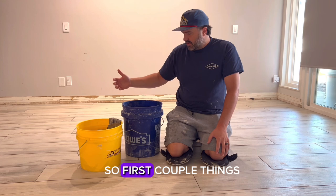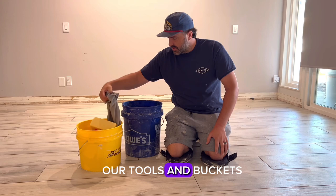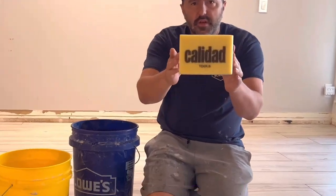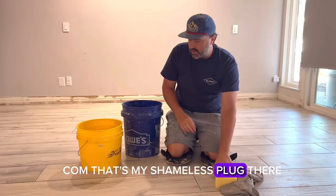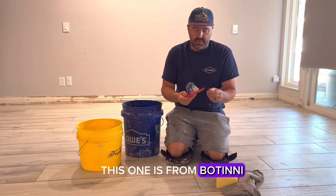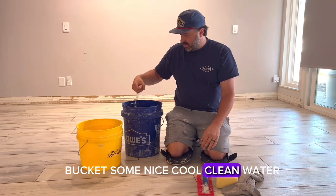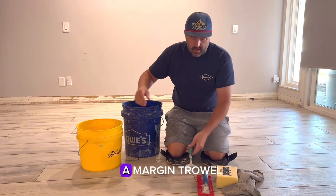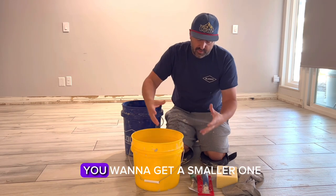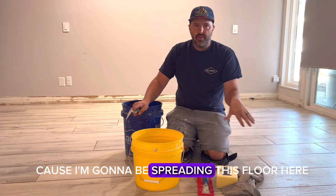First, we got to have our stuff right — our tools. We've got buckets, some microfibers, you'll need a sponge — you can get these at kellydeadtools.com, that's my shameless plug. A grout float — I really like these red rubber gum floats. This one is from Bettini but Troxel makes a really good one as well. A bucket of nice cool clean water, a margin trowel, and another nice clean bucket where we're going to be mixing our grout. You want to get a smaller one; it might be a little easier.